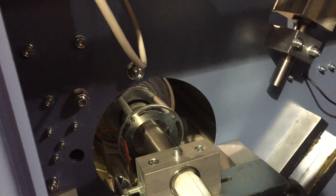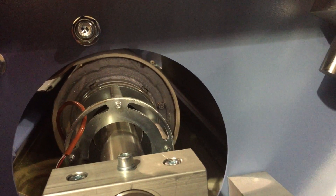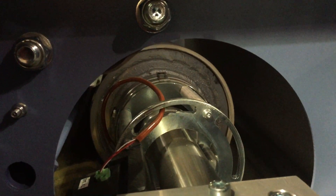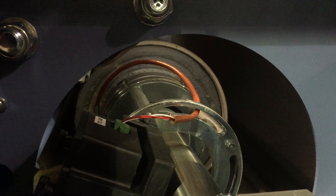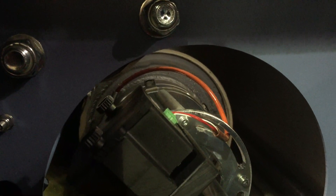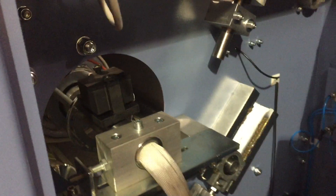This is the same as other AIT rotary heat presses: the oil-heated drum, an eight-inch diameter heated drum. The orange casing and wire you see is the thermocouple, mounted in the drum. The big black box coming by is a transducer that takes the information from the thermocouple — kind of like a thermometer checking the temperature — and transfers that information over to the touchscreen PLC.